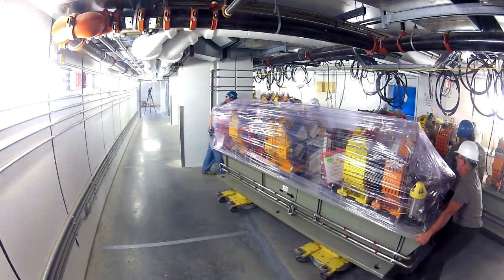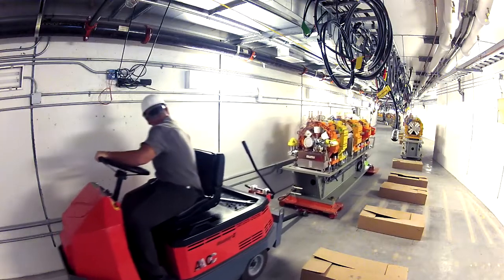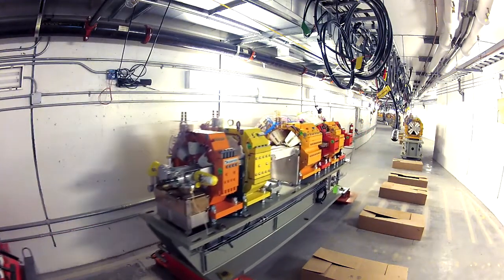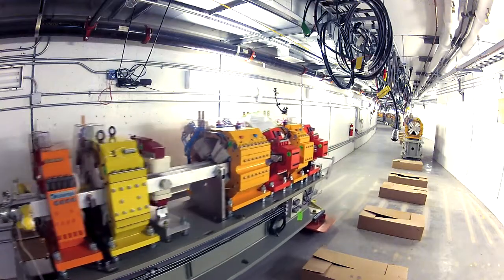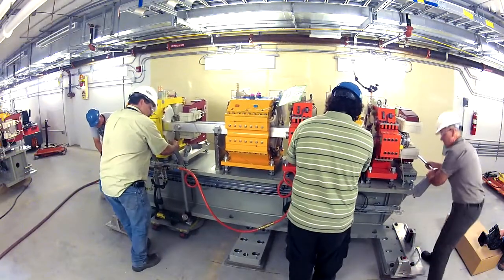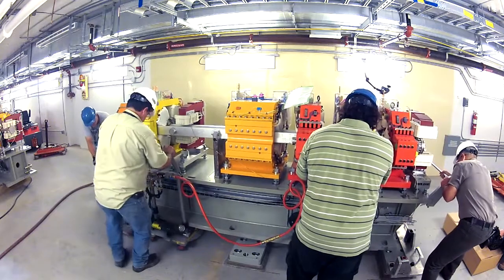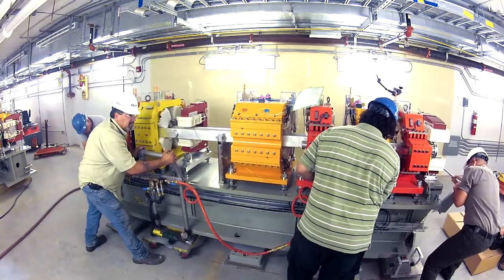The capacity of these air casters is about 12 tons. Our largest girder weighs in at 10 tons and holds quads, sextupoles, and corrector magnets. The dipoles are installed separately on smaller girders. Installation will be completed by June 2013, at which point the tunnel will be filled with 150 girders holding a total of 810 magnets.